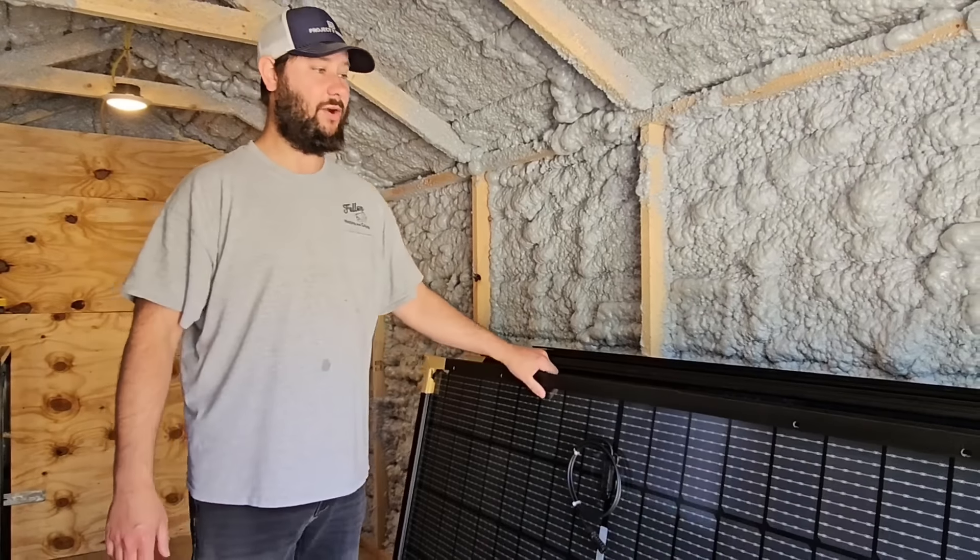I've got a PV isolator or disconnect for that mini split and some 10 AWG PV wire. Now that we've got everything unboxed, we can see what we have. We've got the indoor unit, the outdoor unit — this is an EG4 Electronics ductless mini split. This is a single zone, so we've got one indoor and one outdoor unit that connect together. This 12,000 BTU, or one ton, mini split system can heat and cool up to 600 square feet.